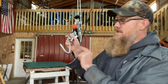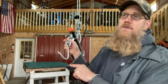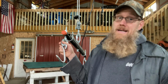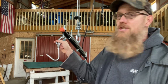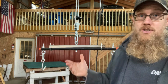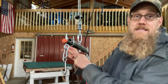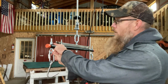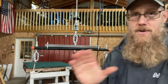I didn't understand what these were. These are single trolley hooks. I got these from Southern Indiana Butcher Supply or something like that. I called, talked to a guy, and away they went. They were in my house in 3 days, and these were just shy of $11 a piece. Of course, you throw on shipping, and you're spending $30 for 2 of these things. These are just what we call quick links, half-inch quick links. This is a half-inch eye bolt, and then I threw a washer on there and a double nut, and that allowed that thing to swivel, which is super convenient.